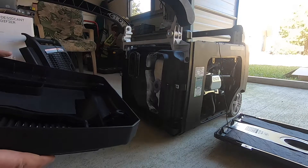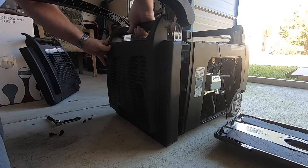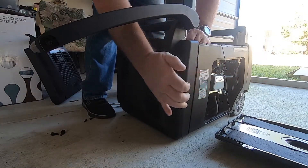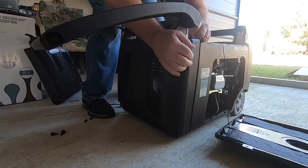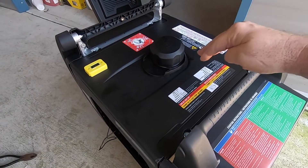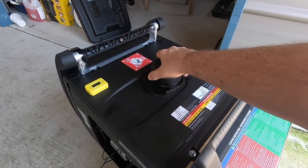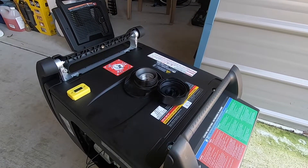With the new end piece, let's go ahead and install that. The two inside bolts are 10 millimeter. This plastic is quite resilient. The top cover is back on with its four bolts — it takes some manipulation with the plastic to get it back in there, as some pieces kind of snap in place. You do have to take the fuel cap completely off in order to get the top off. So I've just got to do the handles and the fuel cap, and I should be done.